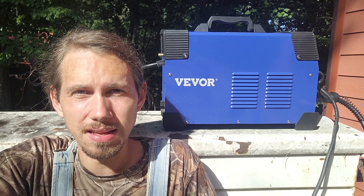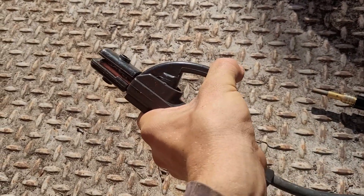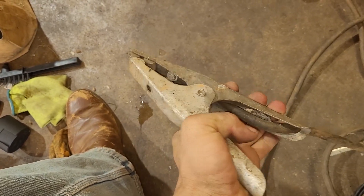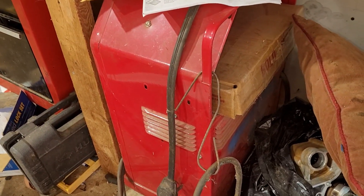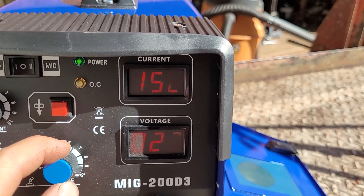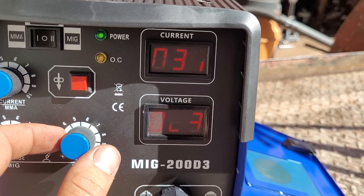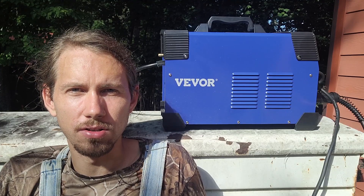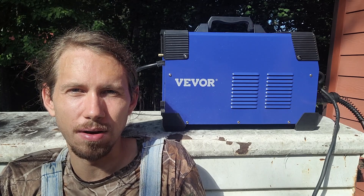The negatives — the things I would like to see done differently: the ground clamp needs to be upgraded, get a heavier duty one. The stick lead needs to be upgraded too — you can see this one's pretty cheap, but you can just swap them out, no problem. Here's a much better clamp — this one's way heavier duty. These are off a Lincoln tombstone. My number one pet peeve with this is the current control and the wire speed — you can see you can't change them independently of each other, so they're stuck locked together. I don't like that because it doesn't give you that much flexibility. It's kind of good for just set it and go — a newbie or beginner can just set it and forget it. But it's annoying to me because I would rather be able to control the current separate from the wire speed so we can get it feeding slower or faster with more or less current and get it set up exactly how we want. But it gets the job done.